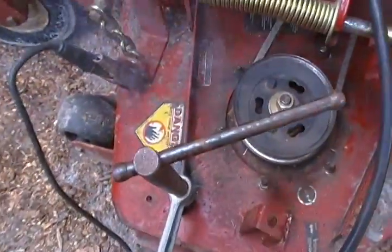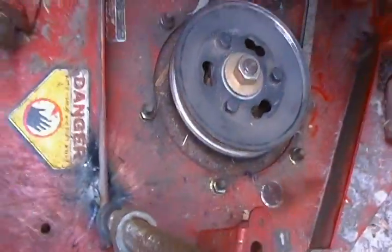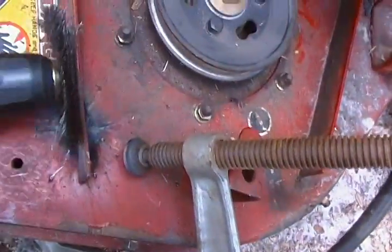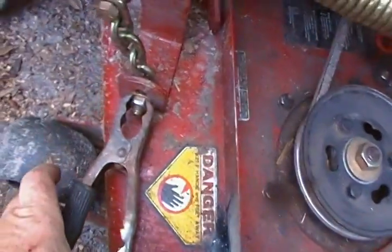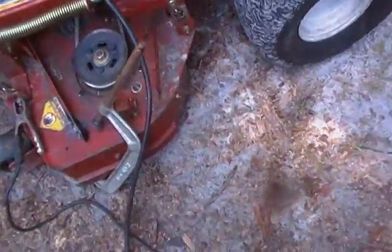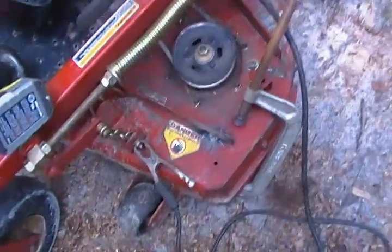You get the idea — it's pretty easy. Now I don't want to weld all the way down this thing. I failed to mention what you need to do is take a wire brush and clean the area that you're going to weld. You also have to hook the negative onto something solid — if you hook it on right where it's painted, it's not going to make a connection. So I usually go to a bolt. It's on there pretty good. The way a real welder will test his weld is he'll take a hammer and do it like that — if it comes loose, he did a crappy job. So that's good enough right there.